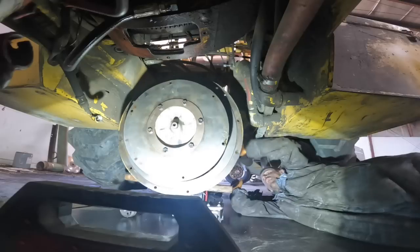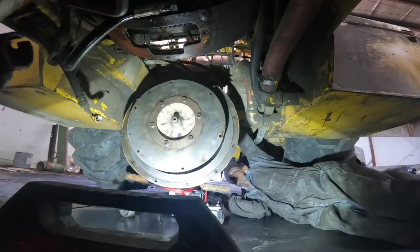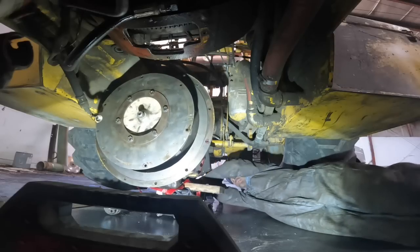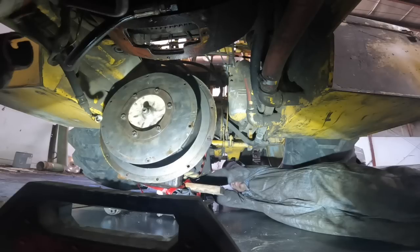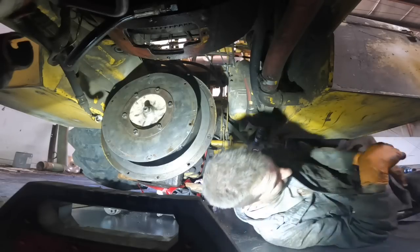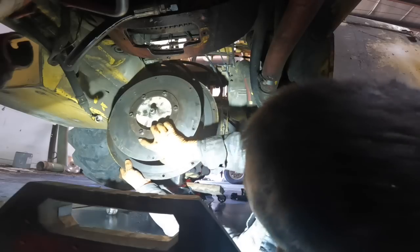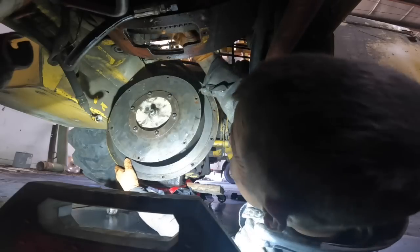Okay. It's a heavy unit. Whoa! Look out, lassie! Okay. I need to get something else going on here. Something like that, maybe. A little bit of back angle on the situation here. That's more better. Make sure when it tilted forward, my torque converter didn't slide out on me. That's been known to happen. Hoping that it's splined up with the pump. Kind of looking at the difference between here and here, and it looks like that's about right.